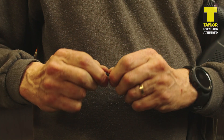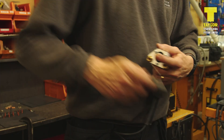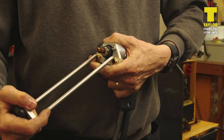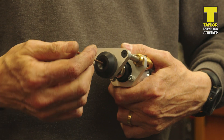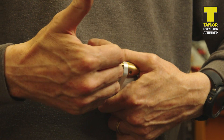Insert the chuck backstop first into the lock nut on the pistol, press the chuck fully home and secure in position using the chuck key provided. Once the chuck is fitted, slide the legs into the pistol and slide them all the way back. Take the nail stud to be welded and insert it through the guide in the foot adapter and fully home into the chuck.